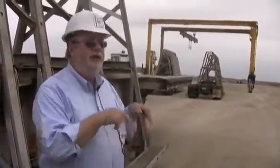Out in the field, when you go out and see ready mix being poured, the guy will say, give me an extra 10 gallons of water in there, and that's when you see the concrete flow down and it looks like water. Okay, that's a reality of what happens. In a precast plant, that is not allowed to happen because there's always a record following it.